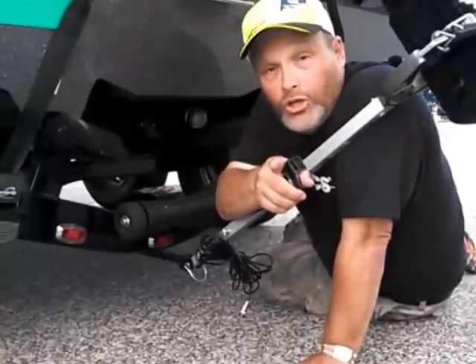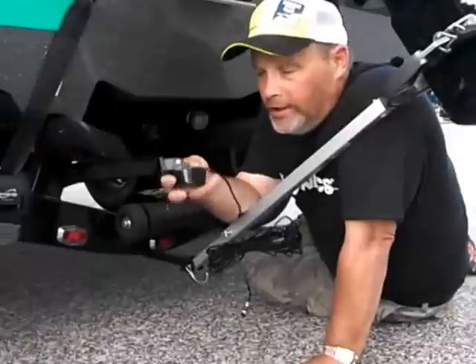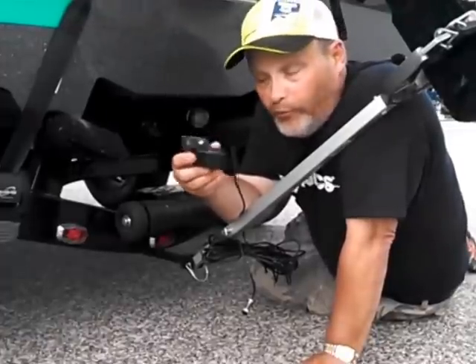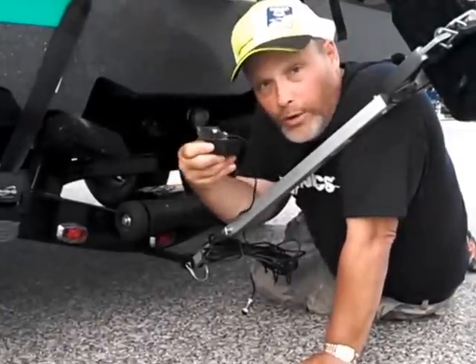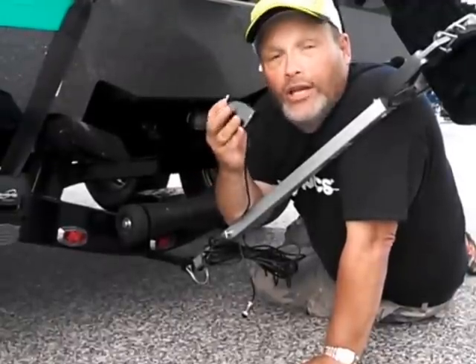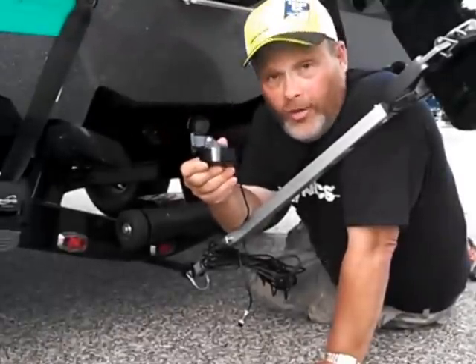One of the things that you can do is actually have a little water in there and put a small bag of sand on top of the transducer and go for a test run. You'll find the best spot in the rear area of your boat because even without gluing it in, you can get good contact with the fiberglass hull as long as there's water in the bottom of the boat.